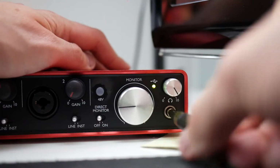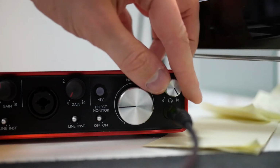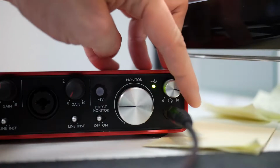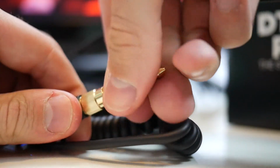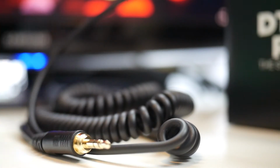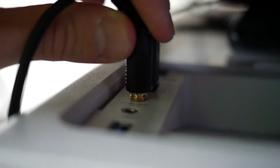entire room. So the 6.3mm jack, or call it the TRS, is going to my amplifier where I adjust the volume. I have a video on this amplifier in the description, make sure to check it out. If you screw off the TRS piece, you can actually put it in your laptop or your PC, because now you'll have the 3.5mm jack I was talking about before. You can put this in your PC, anything that has this aux. A lot of people just call it aux. So there you go. That's how to do it.